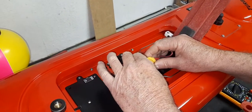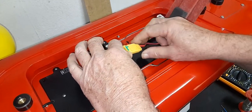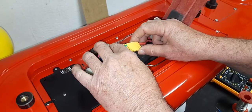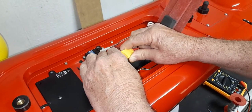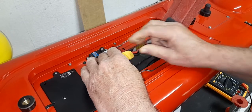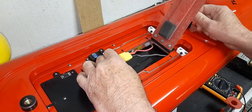First, make sure your battery is fully plugged in. This particular plug set is a two-part set — it's got an anti-spark connection when you first connect, and then you've got to push it all the way home for the plug to handle the current that the boat draws. So with the plug fully plugged in, switch it on — still nothing.